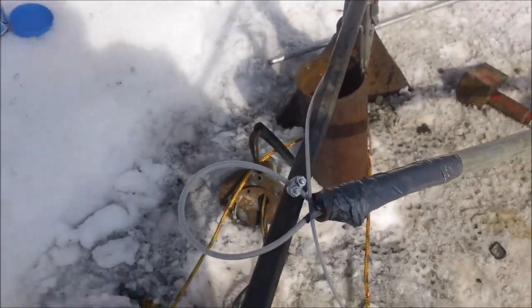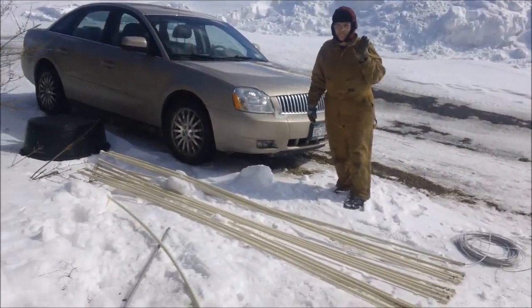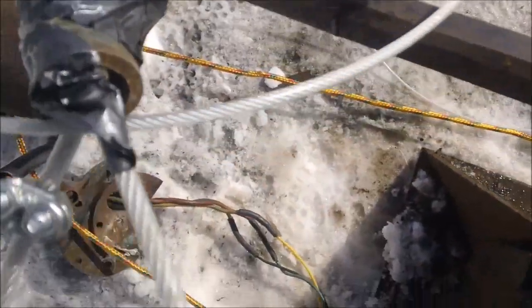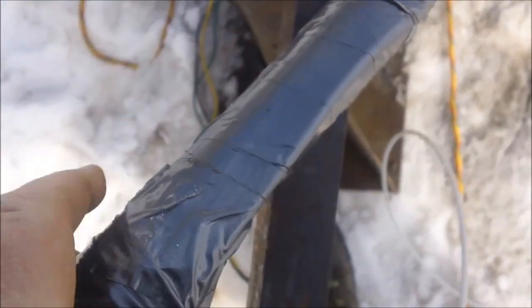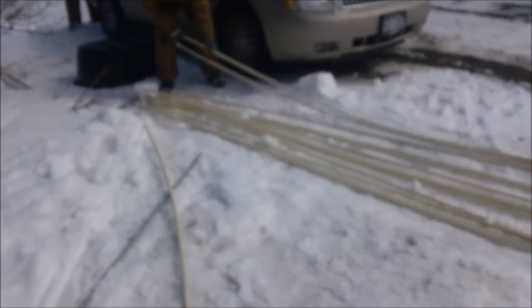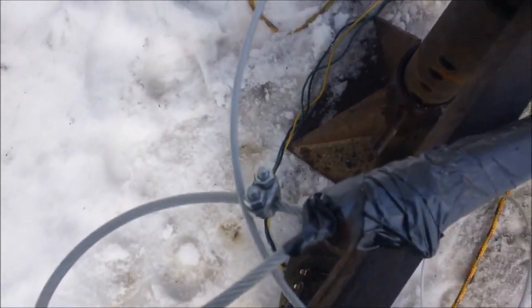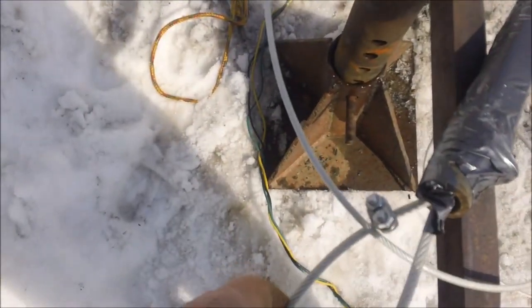This is our first attempt at doing the well. I came up with a scheme of having a lasso and a cable — you can't see it because we have it taped up — but I drilled the hole and fed the cable through so it comes up alongside here, then put a clamp on it so it's not likely to come out. Then threaded the cable all the way through 160 feet of pipe sections. The idea is to slip this over the old pipe and push it all the way down to the bottom using the PVC to push it, then pull the cable to try to get a good bite.